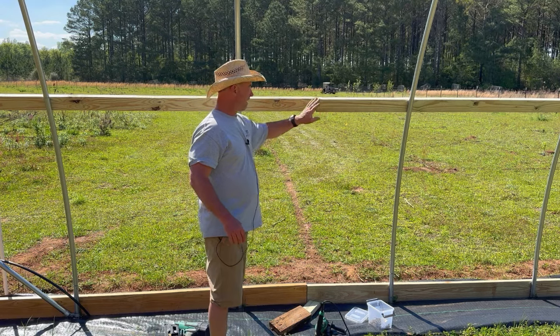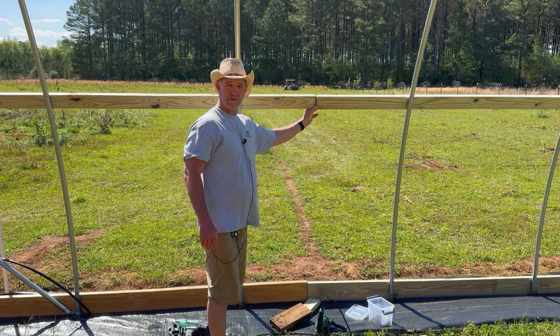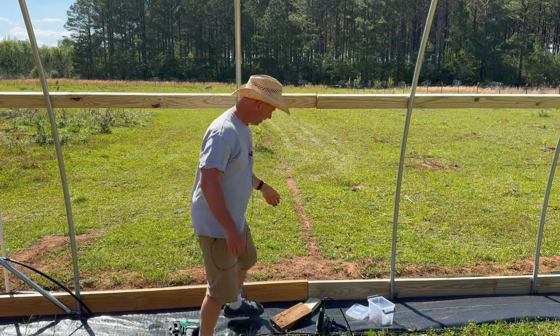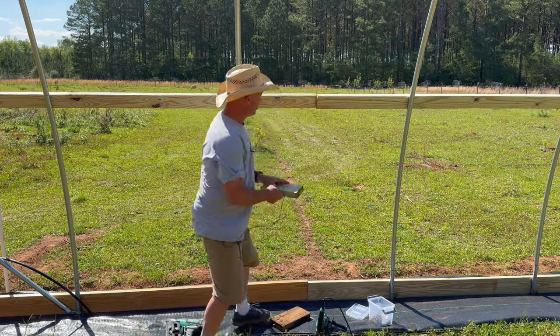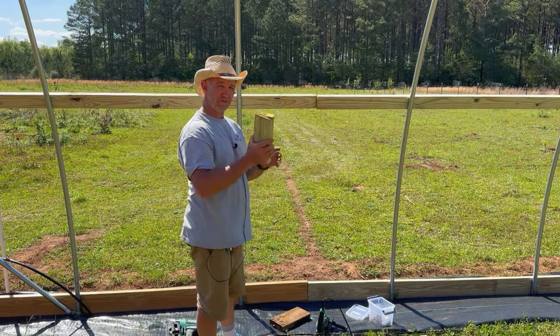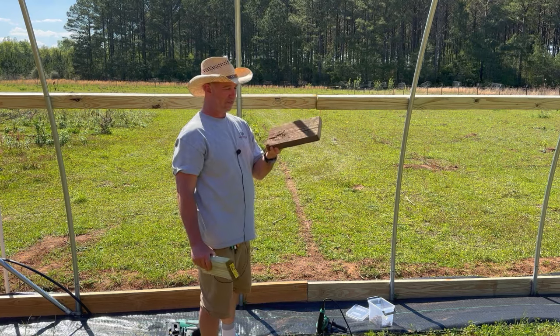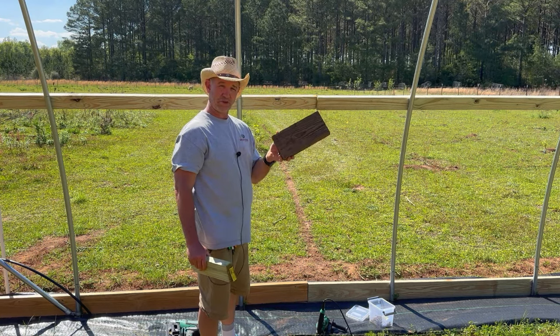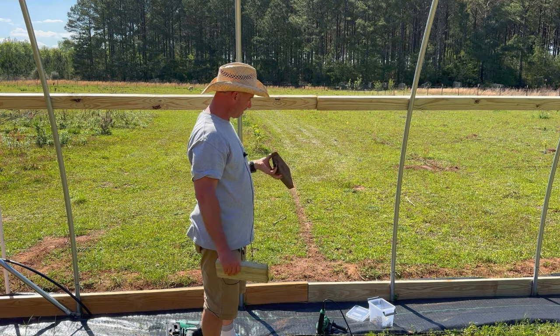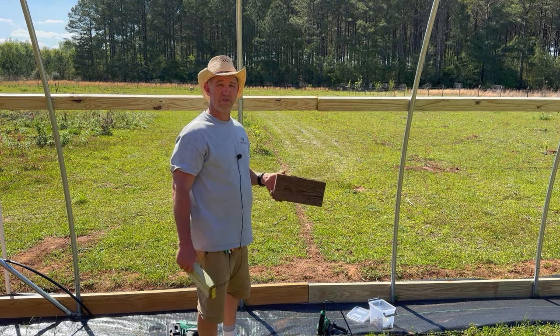All right, now that we've got our hip boards up and our base boards up, everywhere where the boards meet, we've got to put in a brace to give that area strength. So we're just going to take some cutoffs from some 2x4s and some cutoffs from some 2x6s that I had laying around, and we're just going to use this to brace with. I've got some 3-inch carpentry nails in my nail gun, and we're just going to use that.